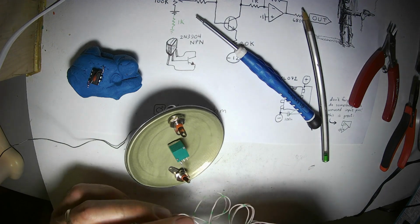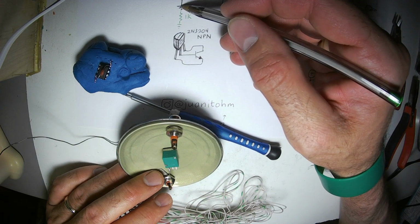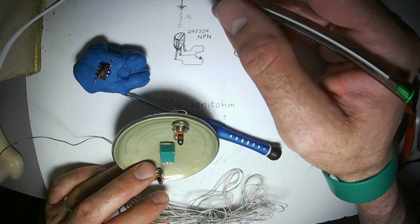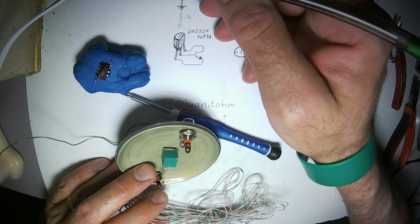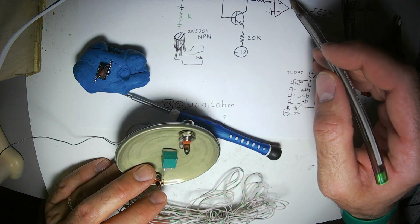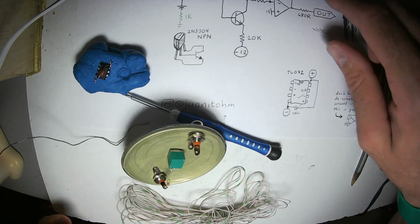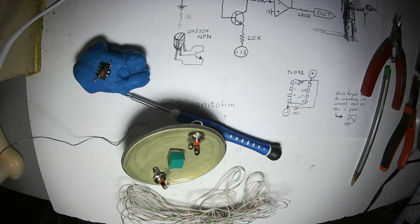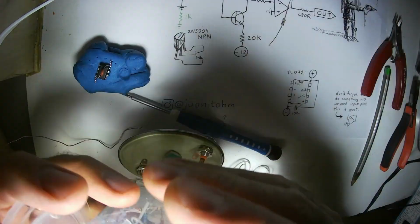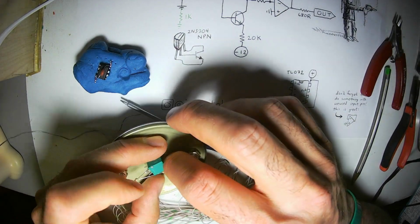The other end of the potentiometer. You know what? I'm actually going to include this 1K resistor from the south end of the potentiometer, the low end, to ground. That way we can test the idea that I had, that letting the input go through at the lowest value, a 100-to-1 resistor divider, go to this circuit. And then this 100-to-1 gain might let, if you put a sine wave in here, maybe a sine wave will come out here. Let's check it out. Here's my 1,000 ohm resistors. Alright, let's put it there.